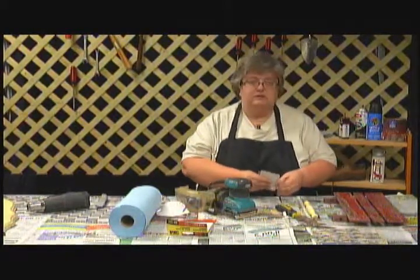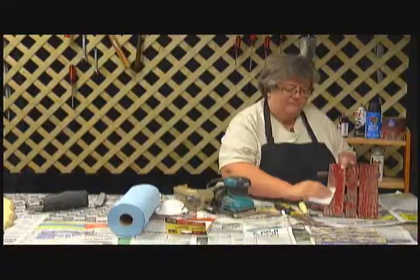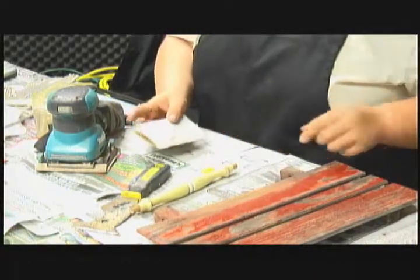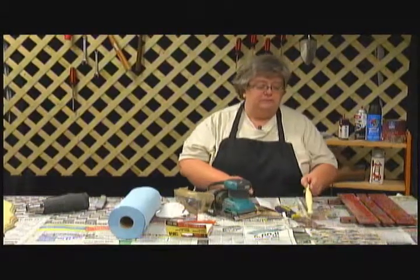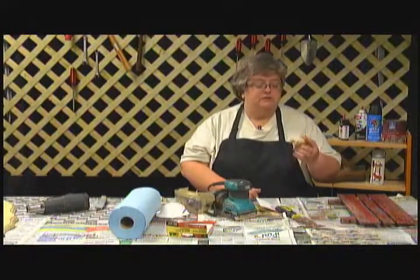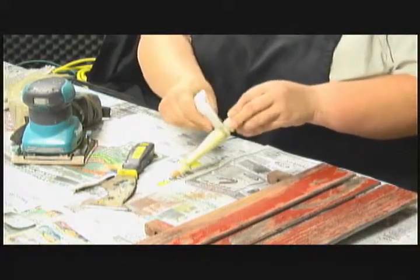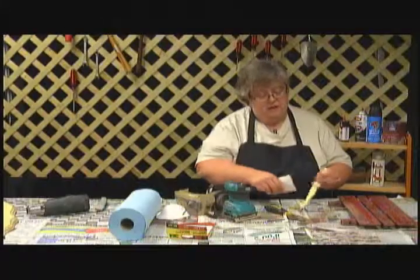If you're just going to hand sand a small area, all you have to do is take your sandpaper and rub it back and forth. The advantage of doing it with sandpaper is you're doing two things at once — you're stripping off the old paint and also getting it smooth and ready, so it's more efficient. Make sure you're in an area clear and away from children, because some of the items you use could be dangerous for them. On round objects, you can use your scraper tool to get into those little nooks, or mold your sandpaper to get into certain areas. See how it's just flaking off and it's going to be smooth.